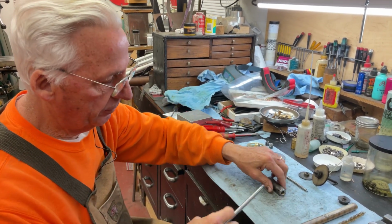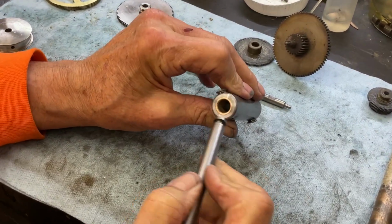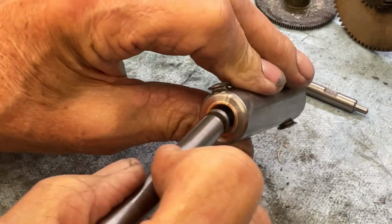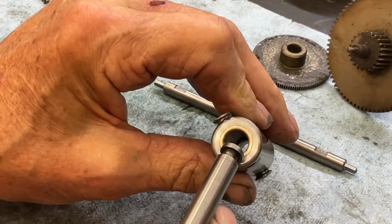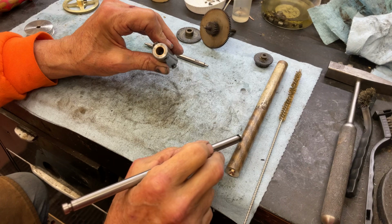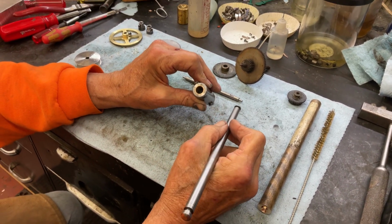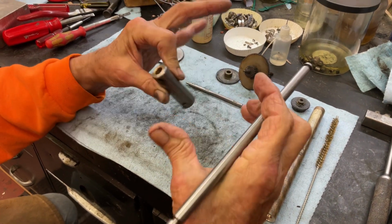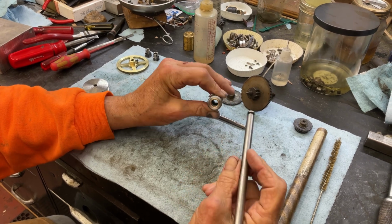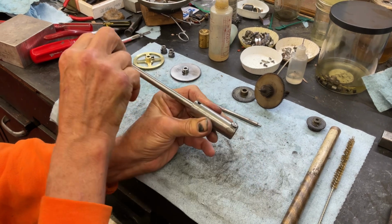So what I've done is I've come in and step drilled the hole out to almost a half an inch. Then I reamed it at a half an inch. And then I built the bronze bearings out of this stuff. This is called Oilite bronze. It has these funny little dark areas in it. It's a bearing material, and they used those in old South Bend lathes, but they were big giant bronze bearings. And then I've chamfered this so when you put it together, it just slides through like that.